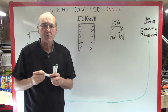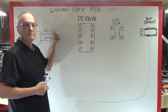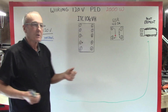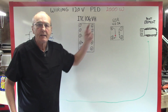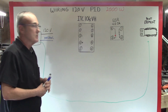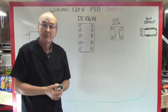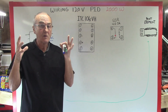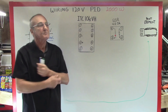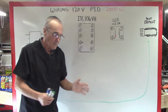Neutral. Okay, now the reason that you're going to need a neutral is, you see, what happens when you connect a hot wire to an element or a device that's supposed to run? Well, nothing, because your electricity only goes so far and stops. It doesn't go anywhere. It needs a path back in order to make what they call, you've heard this, the complete circuit. Well, your neutral allows you to have that complete circuit. So as long as you've got energy going in a complete circle, then you've got flow. You have amperage. At this point, you only have voltage. Okay, so you've got the horsepower, but you don't have any flow until you connect it to a neutral. So you've got to give it a place to go. It will be utilized at the point that you connect it, but you still have to have that flow for the current to return or the voltage to return.